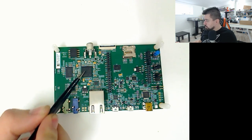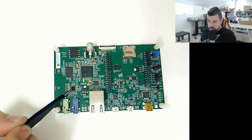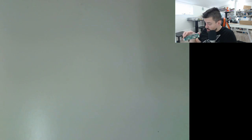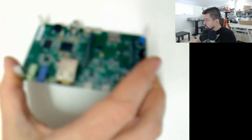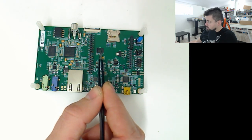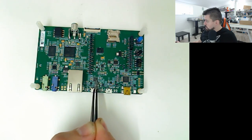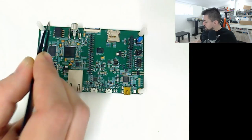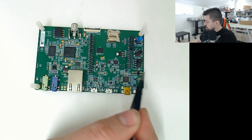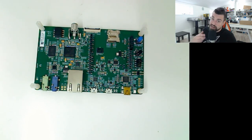We have the main chip, SDRAM over here, the Ethernet PHY down here, and this chip is the audio codec. Then between the Arduino headers, we have the QSPI quad-SPI flash. We have some regulators, the ST-Link is down here, USB, a host of connectors up top - the external header, SPDIF, camera interface, microSD, user button, reset button, and some power selectors. There's a lot of stuff in this board that I don't need.